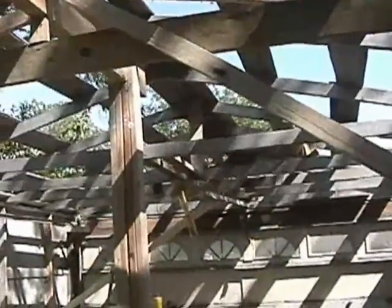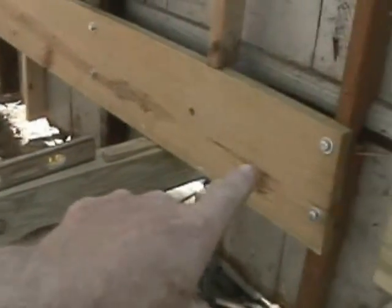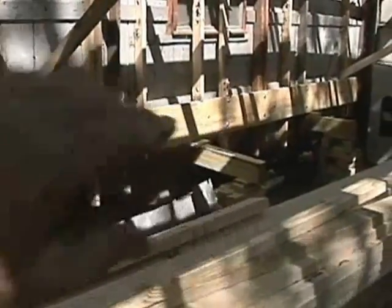There are a lot of things you've got to consider before you come in and get ready to pull your foundation. You want to make sure that your building is really braced real well. We've got it up and stabilized with our 4x6s, all tied in on the ledger beam. It's basically just sitting on these supports right now because we've got to move it around a little bit — some of these walls are a little in, and we need to push them out.